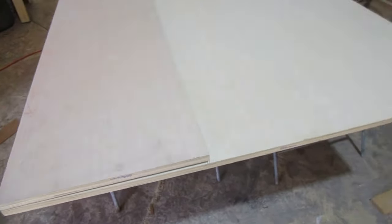These shelves are going to be eight foot tall, 16 inches deep, and 32 inches wide. If you take the plywood and get the most you can out of each sheet — if you take that 16 inches, you'll be able to cut three uprights going that way. And if you take the 16 running from one end to the other, you'll also get three slices. So you use every bit of the sheet if you make your shelves the same size I'm making these.